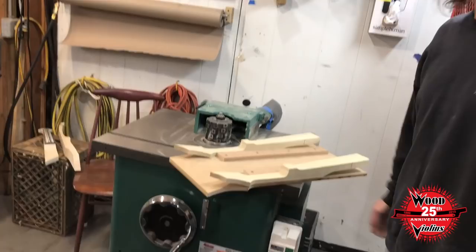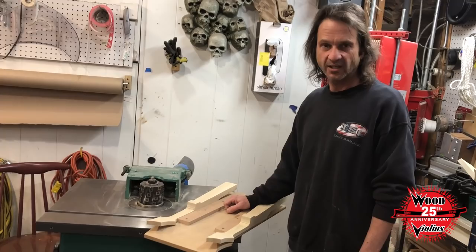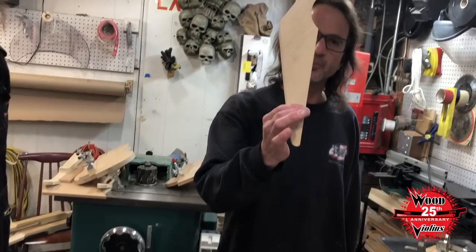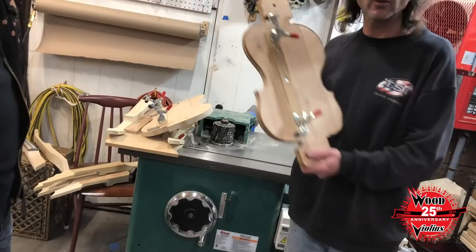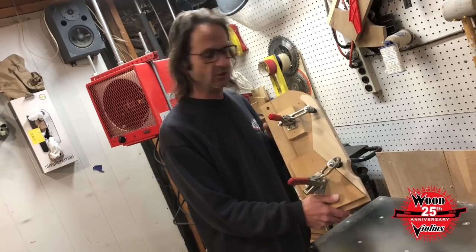To achieve the final shape, we go over to this piece of machinery called the Shaper. This template gives the Vipers our final shape. After being clamped to this board, I run them past the Shaper head and it gives them the profile they need for the correct fingerboard. Over here we have our various router table fixtures — this is how we achieve our final cuts and final shape on all of our wings. This is the fixture used to finalize the shape on the Nashville wings, and here is a base wing for a Viper attached to the fixture — its next step would be to run past this router head to get the final shape.